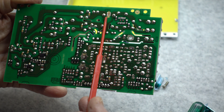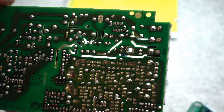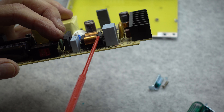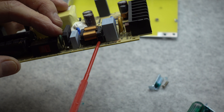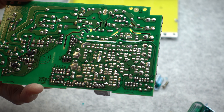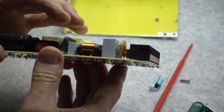There's an interesting little feature that looks like a little tooth — it's a spark gap. It's designed so that if a surge occurs, for instance from lightning or something like that generating a very high voltage pulse, it will be shorted across and bypassed to ground to hopefully prevent blowing up the power supply.